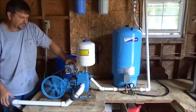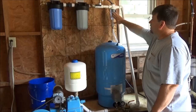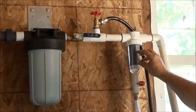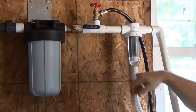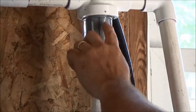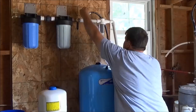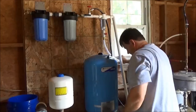We're doing some adjustment on the old pump, which is about 25 years old and doing great. One important thing: make sure your plumbing is set up so you can back-flush this filter. It's a spin-down filter, but to back-flush it correctly you need to run water against the arrows. I don't see any particles in there — it's pretty clean, we already back-flushed it once. The screening on that is 100 microns — 104 micron — and it's nicely flushed out. We'll shut that off and back to shutting our back-flush system off, open the valve back to the house, and shut all the other valves off.